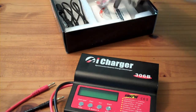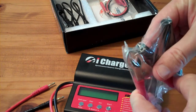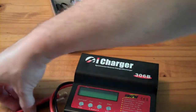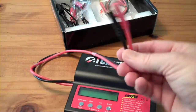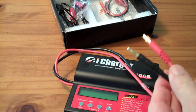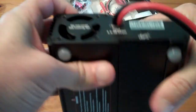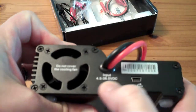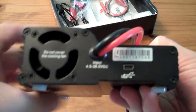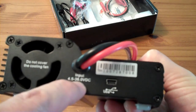There is some open source software called Data Explorer that lets you chart your battery as it's discharging or charging. It comes with these little clip-on power things with the banana jack connector inside. I'm not using those for the power input — I bought a separate cable that I've wired up with ring terminals to connect into a different Nissan Leaf battery bank. Power input here is pretty wide range: four-and-a-half to 38 volts DC. Normally you plug these into a car battery for charging RC aircraft in the field. I'm actually quite impressed it goes up to 38 volts.